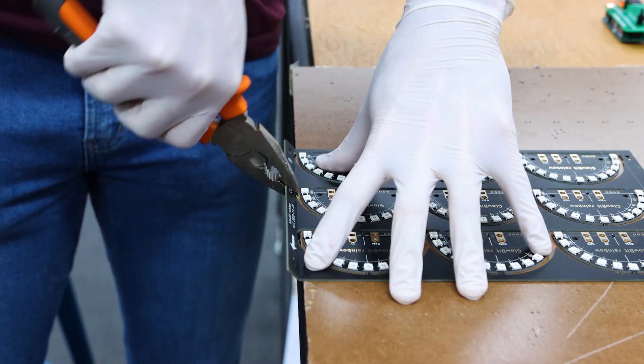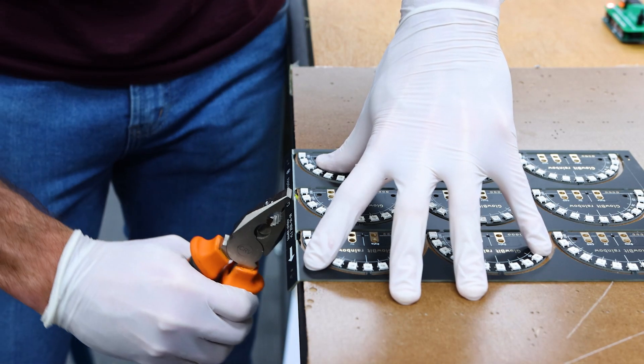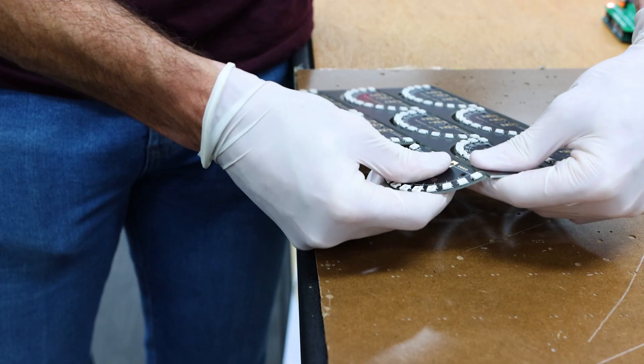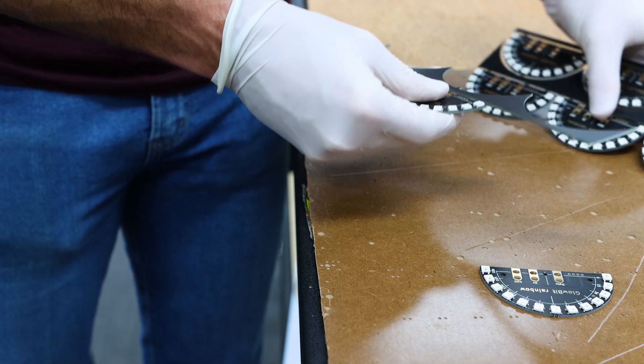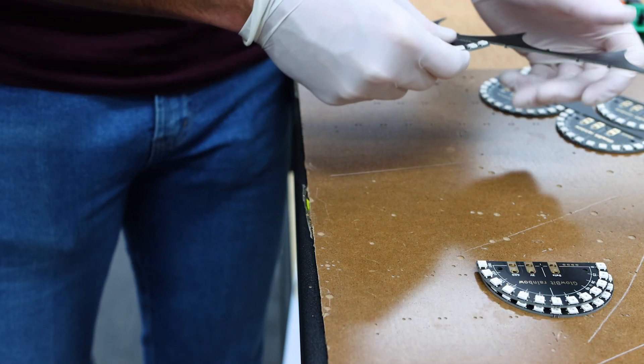The soldering process does leave behind some residue. We're still in the process of figuring out what method works best for us, but in general it's some process of a solvent bath followed by drying. Depanelizing is pretty straightforward — I just snap off the V-cut rails. Here most of the PCBs are routed out except for these local spots called mouse bites or stamp holes.